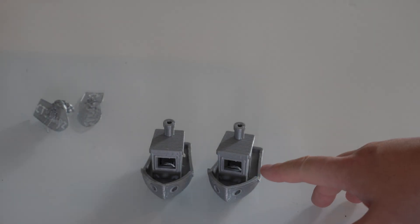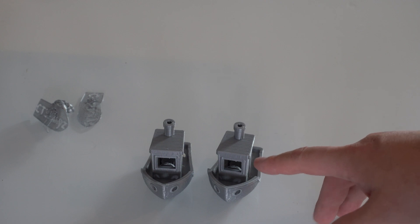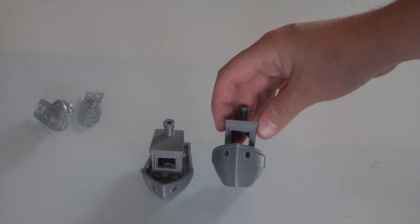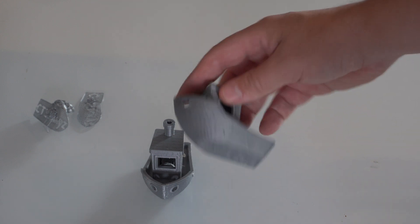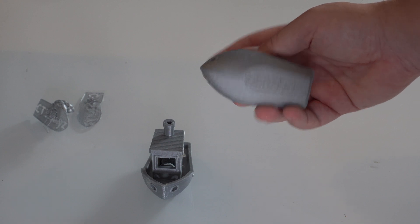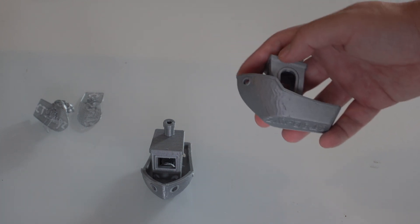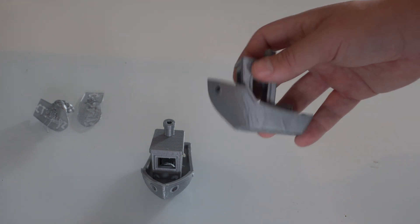After another four hours in the dryer box, a lot of the issues ended up getting resolved. There's no extra filament here. The bridging is a little bit better — pretty much mostly straight with just a tad bit of filament hanging down. The stringing is mostly gone. The bottom looks a little bit better. It's pretty clean overall, and there is a tad bit of bubbling, but nowhere near as bad. It's definitely a step up, so that was after eight hours in the dryer box with a print in between.